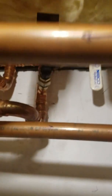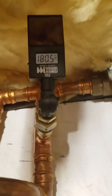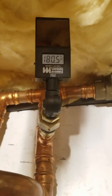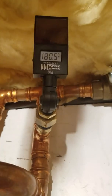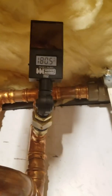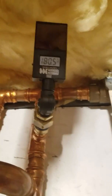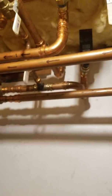As you can see, we have about a 20-degree delta across the heat exchanger — that's great. We're putting 180 degrees to the house and sending back 160, so we rejected 20 degrees of hot water into the home. The house right now is comfortable; it's about 10 degrees outside here in New Jersey — a cold week — but the boiler is doing its job. I last loaded the stove around 2 o'clock this afternoon and it's about 9 p.m. now, and we're still at 180.5 degrees. That draft inducer motor is really helping my efficiency.